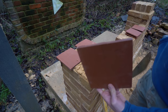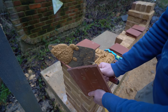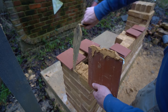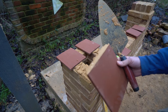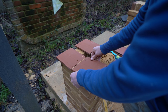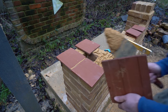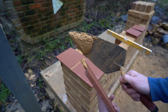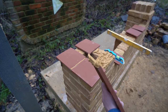Because you're not putting a cut in this side, you butter this end up straight away. Buttering this up can be quite difficult - you do it much the same way as you would a brick on edge. I like to run the trowel down the top edge because you get a much cleaner mark. Just scrape it down at a 45-degree angle and peel off a little bit of that muck, and it should look something like that.